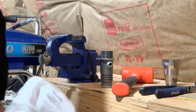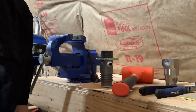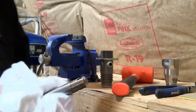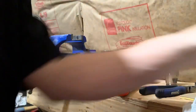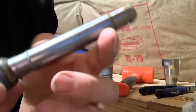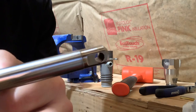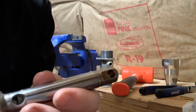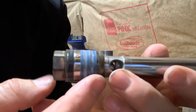I'm always disorganized in some of my videos, but I'm not a professional — I just do this to help other users because a lot of this is self-taught, and sometimes this can be a headache trying to learn on your own. This is what your piston looks like when you take it out. You want to check it over — take your fingernail and run it up and down the shaft, making sure there are no cuts, gouging, or an hourglass effect. If there is, that indicates a problem with your packings.